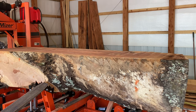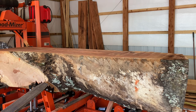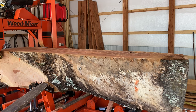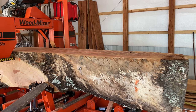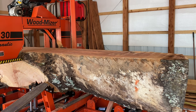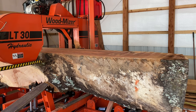The vertical log stops on the other side just come up about a foot tall, and the log of course is 36 inches on that big end, so half of that is 18 — the log stops don't come up to the center of the log, so they don't touch the largest diameter portion. The log is actually overhanging the log stops toward the operator, and I actually had to put lumber against those to shim it back toward the camera to keep the log out of the operator-side guide roller that is fixed to the mill.